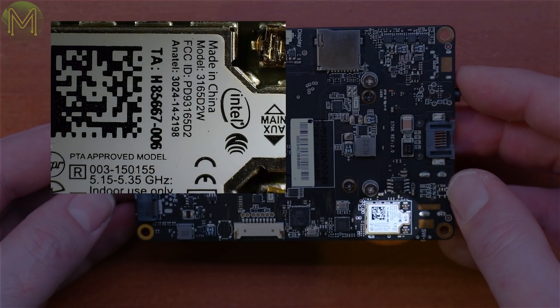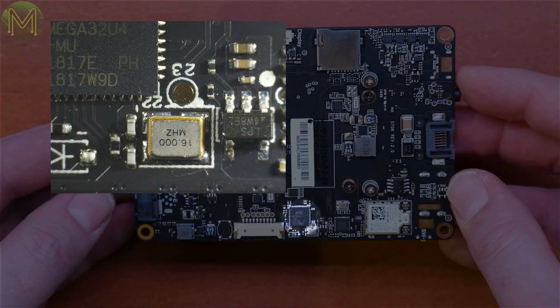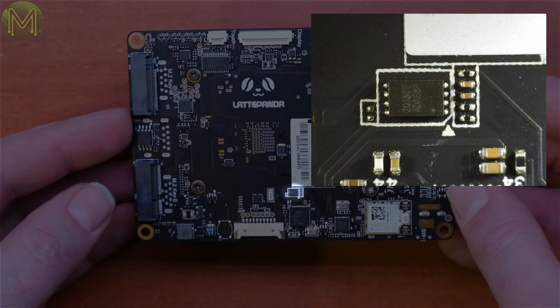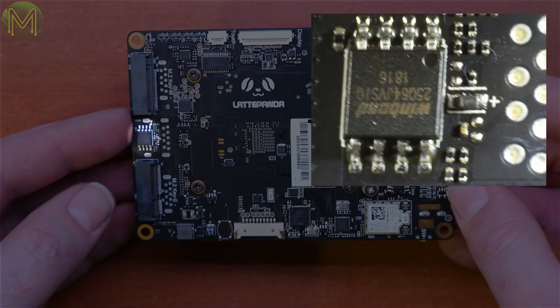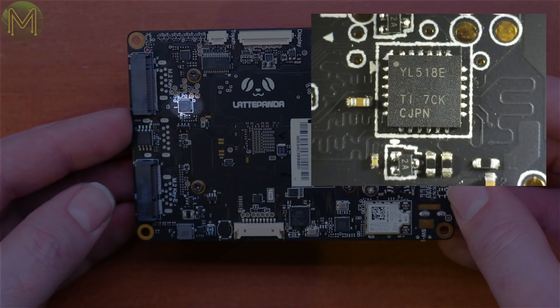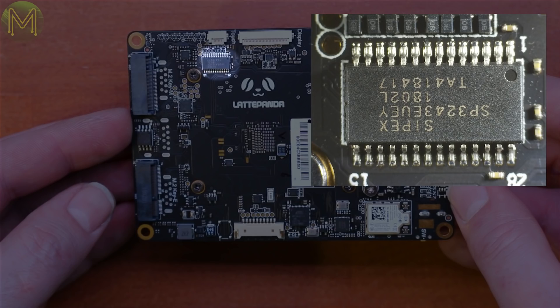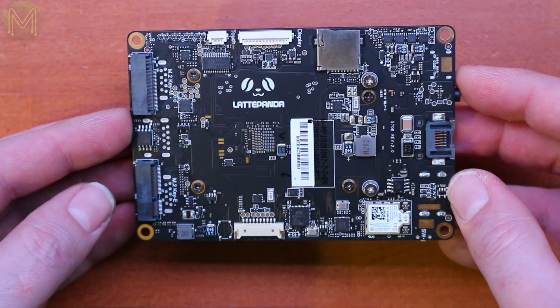There's a variable output LDO capable of sourcing up to 2 amps, a bunch of ESD protection ICs, Wi-Fi and Bluetooth module, USB 2.0 hub controller running off a 12MHz clock, a piddly ATmega32U4 with a 16MHz crystal, more p-channel MOSFETs, and what is probably a DC buck converter given the nearby inductor. There's also Winbond 256Mb SPI flash, possibly a 6-channel demuxer IC from TI, a Sipex RS232 transceiver supporting 3 TX and 5 RX channels, and a USB UART bridge. I'm gathering that the Arduino is connected to the main board via the RS232 transceiver, USB UART bridge, and then the USB 2.0 hub.